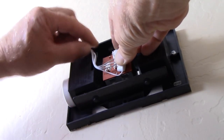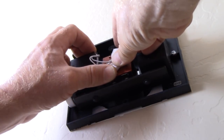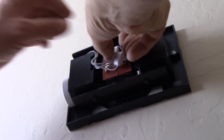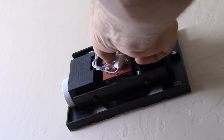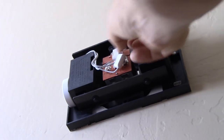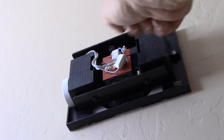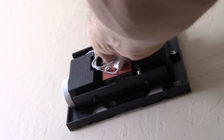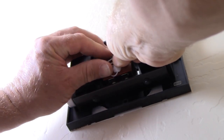Of course I shut off the power that fed the transformer — the 120 volt to my bell transformer. I was lucky my panel was labeled and I knew which circuit that transformer was connected to. You may not be so lucky because they usually just put that on a circuit that's going to be live all the time and it doesn't need to be on its own circuit. So chances are they may not have labeled it on your panel — you'll have to keep trying the doorbell, shutting off individual circuits one at a time until your doorbell no longer functions.